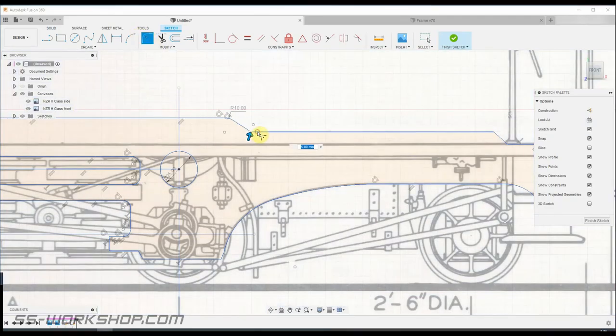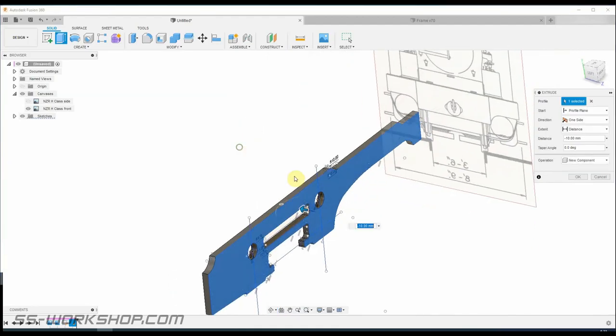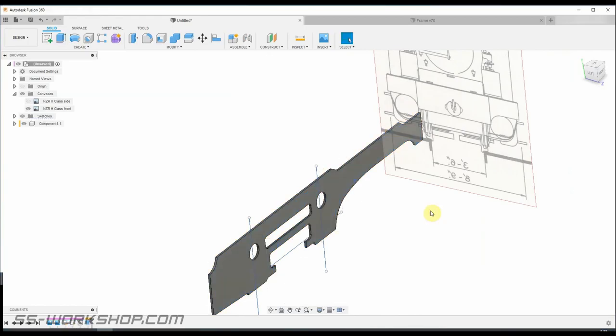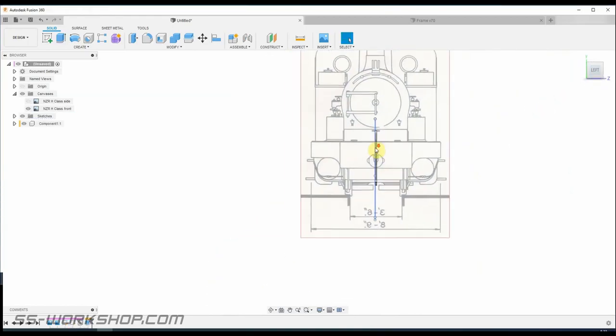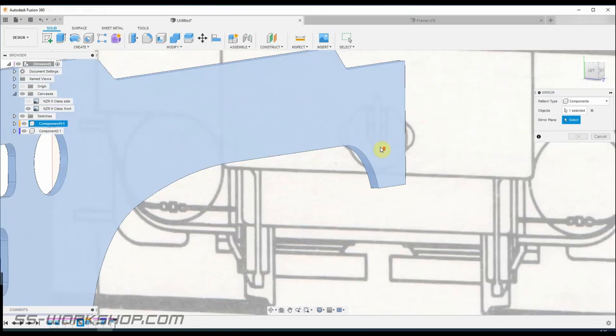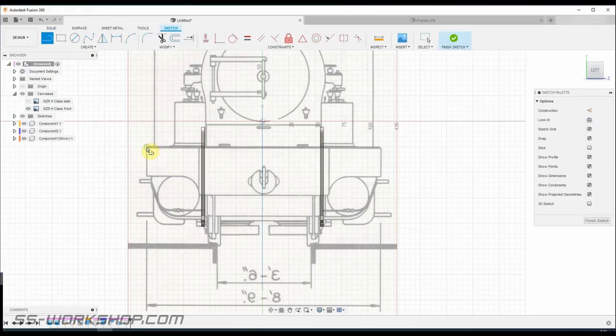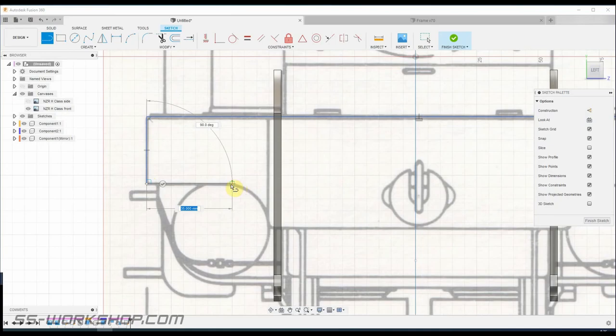Once I'm relatively happy with the outline, the next thing is to turn the 2D sketch into 3D. This is done by what's called extruding. To extrude the part we select the closed area and then set the thickness of the extrusion — in this case the thickness of the steel we're going to make the frame plates out of. This is where your reference drawings really come in handy. You can look at how a similar engine is built and the thickness of the plates, then copy that. After we've got a frame plate, we move it into the correct location by looking at the front view and dragging it to the right position. From there we can mirror the second identical frame plate using the axes, as I align the center of the drawing with the axes, allowing us to mirror each of the parts as we go.